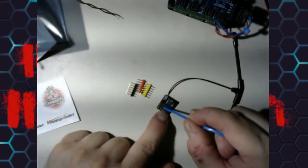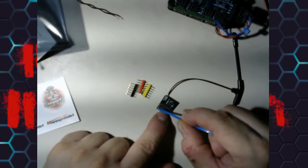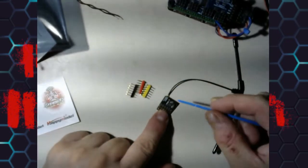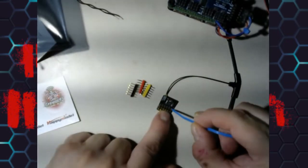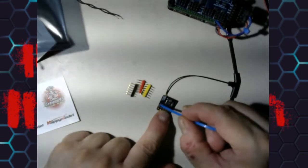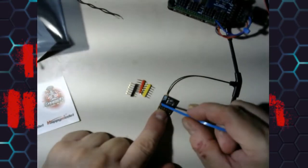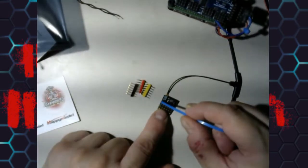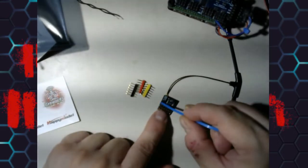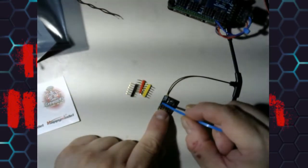That means that on this board, the positive goes past this one and the negative goes past this one. They probably pass on either side of it. And if you look, by number 6 it is actually a little bit wider. By number 1 it's very narrow here. So when you're soldering these, it is quite likely that the narrowness of the board, the mass-produced cheapness of the board, makes it very susceptible to heat here. So I would suspect that the negative was on this side and very close to the edge where it's very narrow and very susceptible to heat.